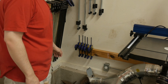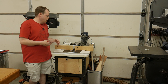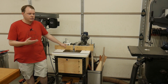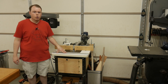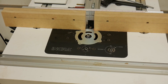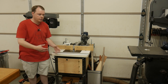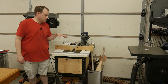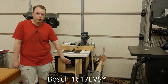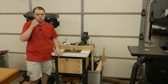My router table is a 24-by-32 style table very similar to Incra router tables. The fence is actually an Incra knockoff sold by a brand called Pinnacle — I picked it up as a demo unit from Woodcraft about four or five years ago. I recently upgraded to the Incra router lift, and that was a game-changer — being able to change bits from the top side of the table instead of opening it up and adjusting from below makes things so much easier. The router underneath is a Bosch 1617VS, two and a quarter horsepower, which is plenty for the roundovers, chamfers, and straight bits I primarily run.